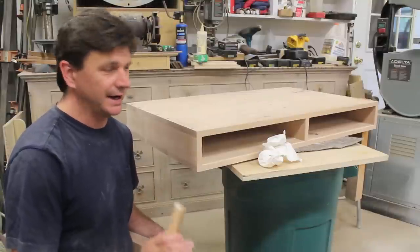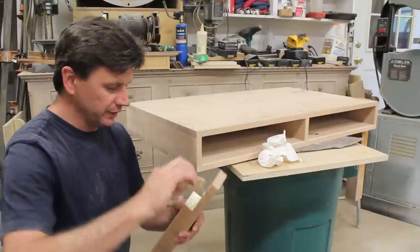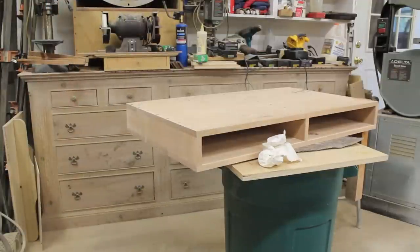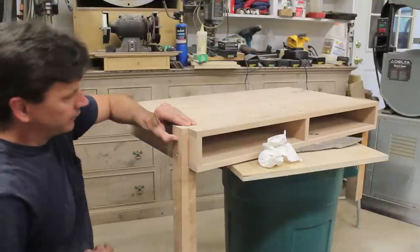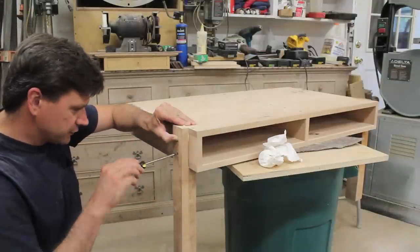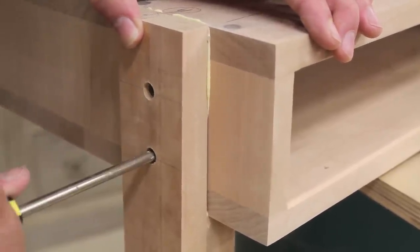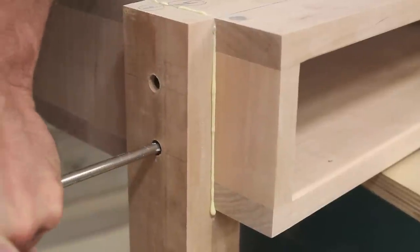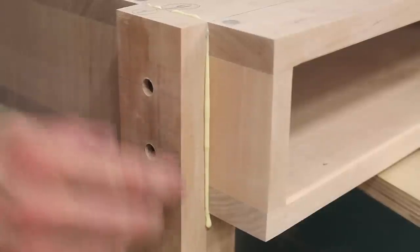Now that the cabinet is sanded, I've started to attach the legs. I'm making sure I put a good amount of glue on the leg where it's going to be in contact with the cabinet, and then it should just simply screw right into the holes it was already attached by — that's why it's important to mark the legs. I'm using a Phillips head screwdriver, not my screw gun, because I want to feel the tension of the screw. You see all the glue squeezing out? That's a nice glue joint — these screws are just acting like clamps. The strength isn't really from the screws as much as it is from this wide glue joint.